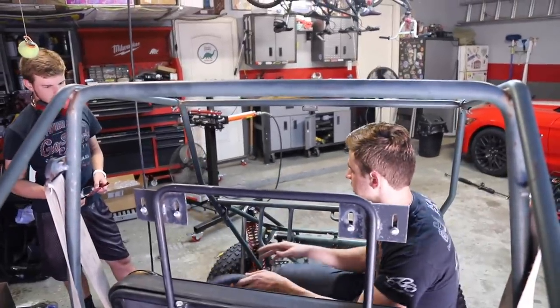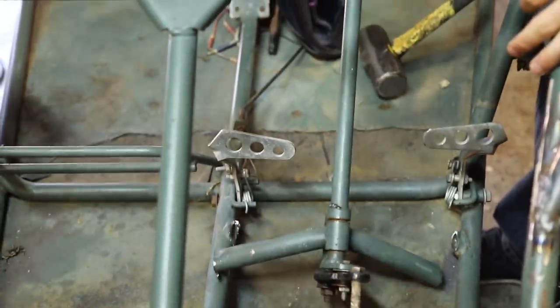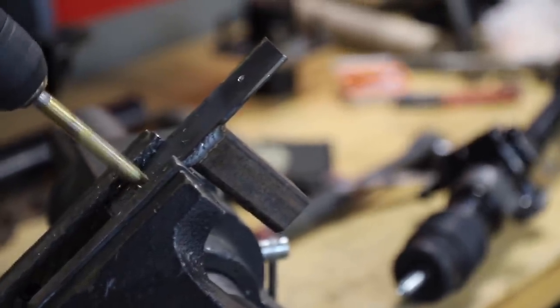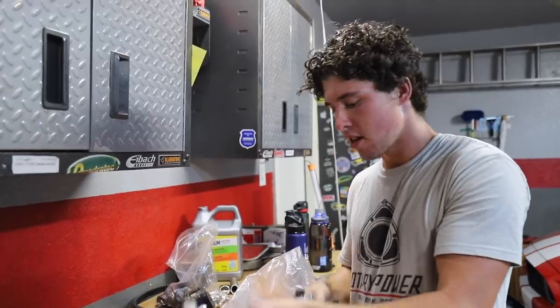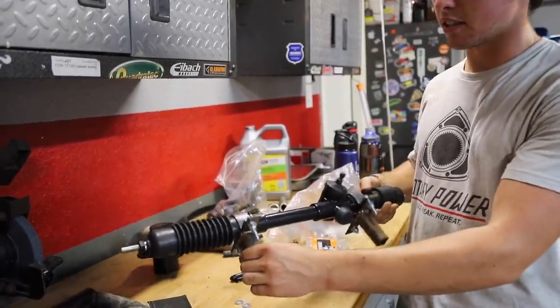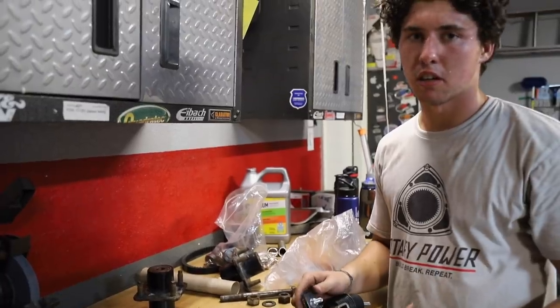With the wheel off, the first step is cutting out the steering shaft and braces up front, then putting in our new steering. We're bolting up our Go Power Sports rack and pinion. Before we've used U-bolts on smaller carts, but because these are 20 inch tires steering over rocks, I made up custom brackets that fit right up in here. I'm actually pretty proud of this — it's hard to bend stuff around curves and this came out really tight.